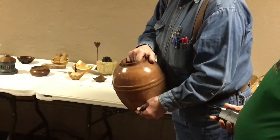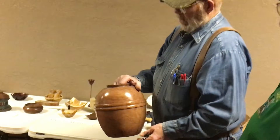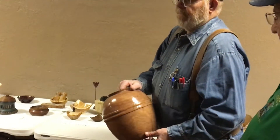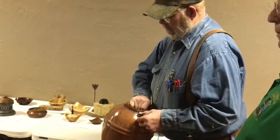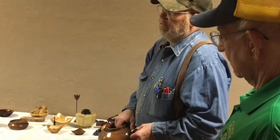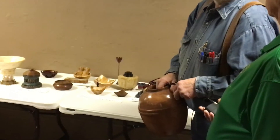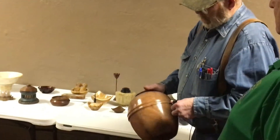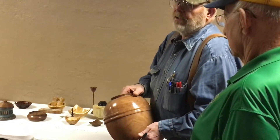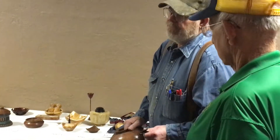It makes a hollow spot — yes, and that's one whole log, one piece. This tree is probably 150 to 200 years old — that big in mesquite. You'll get ring shake in a lot of woods, and you can deal with it, but it's a lot of trouble. I haven't had a problem turning it as far as it trying to separate, and you can stabilize it as you go. But it really leaves some pretty neat-looking stuff even though it isn't perfect.